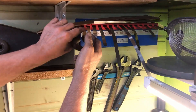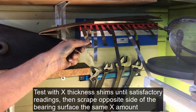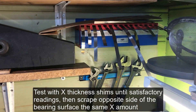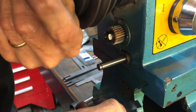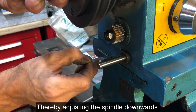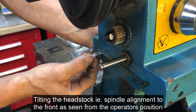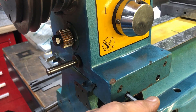I can of course use shims. The thinnest I have is one hundredth of a millimeter, and I'll introduce three of those just for testing. These are very thin. I lift up here, insert one there, the second one here, and the third one in the dovetail here, then snug it down again. This will move it in the direction I want it to go.